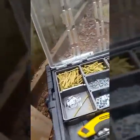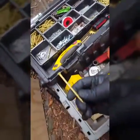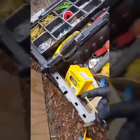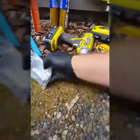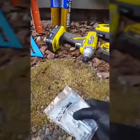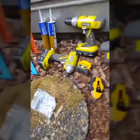Screws, you'll need a Phillips head screw piece to put on your latches. And then I recommend using decking screws. You want 2 lengths. You want about a 2.5 to 3 inch, and then you also want about 1.5 inches to help put the frame together. You'll also need a drill bit to make the hole for which your latch is going to secure into, because you won't be using the second piece. You'll just be using the latch. So those are the parts.